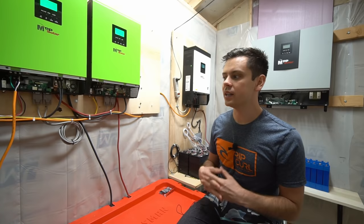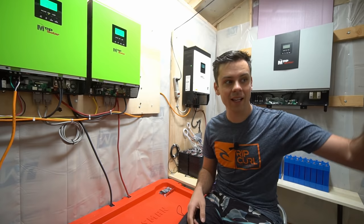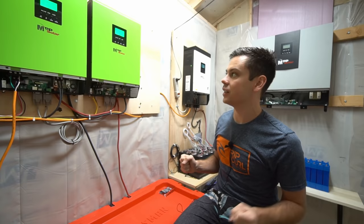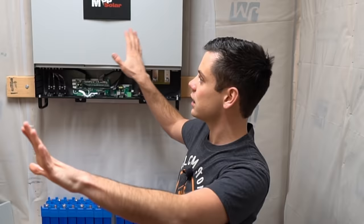The next challenge I'll update you on is powering an air conditioner in here off of less than a thousand watts of solar panels. Here in Las Vegas it gets very hot, but if I insulate the shed enough I think I can keep it cool. I've already sealed a lot of holes and insulated one side — I need to insulate the other side and seal more cracks to keep the temperature at around 80 to 90 degrees all summer.